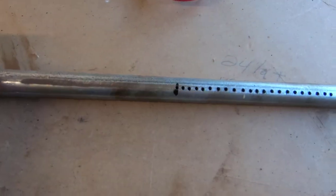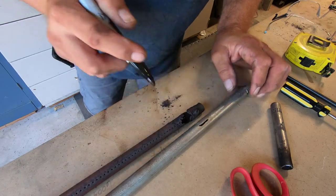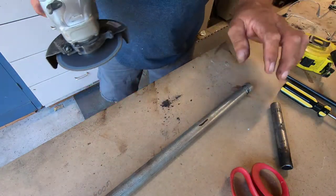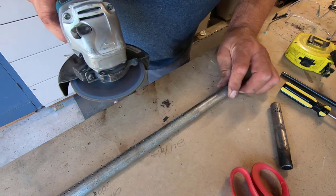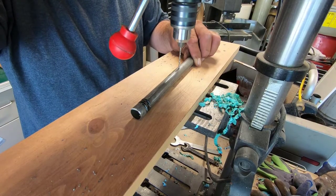Now the holes don't have to be in a straight line, just pretty close. Now I'm going to mark out where the gas transfer holes go. These holes are necessary for the other burners to ignite — if you didn't have these you'd have to ignite each burner separately. Here again I'm taking the grinder to put flat surfaces on the round pipe. Now I'll drill those holes.